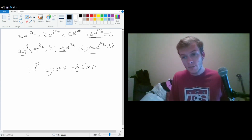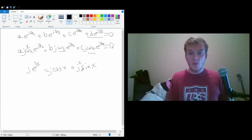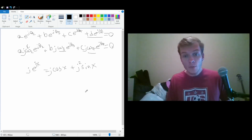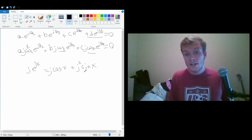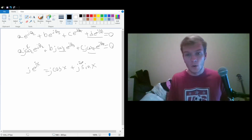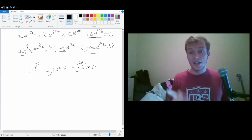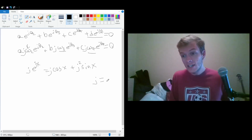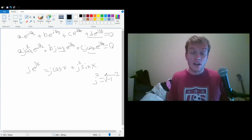So if we multiply cosine by j, we multiply this sine term by j, that gives us j squared. So j times j, this is just imaginary number times imaginary number. If you're up to date on your imaginary numbers, you know that an imaginary number times an imaginary number makes -1. If you take the unit imaginary number and multiply it by itself, it gives you -1, because the way that we define imaginary numbers is that j is equal to the square root of -1. So if we square j and square this side, we get -1.